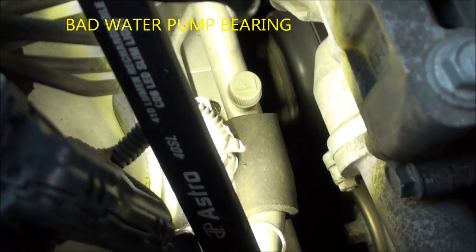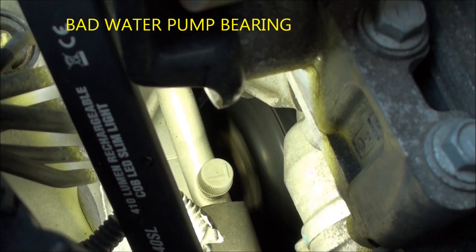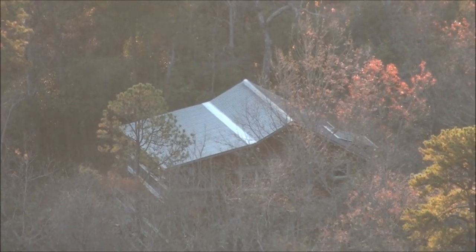I hope that helped if you're having this problem. Make sure you cross-reference the part number with your VIN — Toyota changed the switch several different times, so there are different switches out there with different connectors and different contact logic; it might be open when you need it closed and vice versa. Or you can do the old bypass trick. Thanks for watching. This bad boy also needs a water pump — the pulley is wobbling like crazy, so that one's coming up next. I'll need to raise the engine a couple inches to access those bolts. Don't forget to subscribe if you haven't yet — see you on the next one.